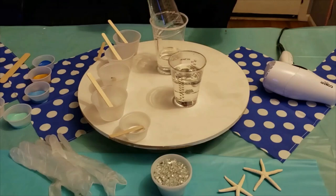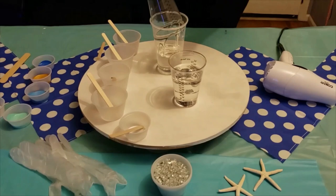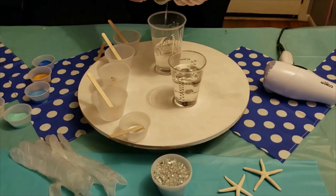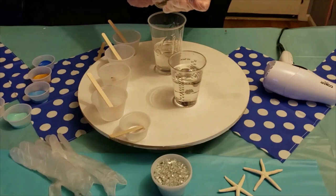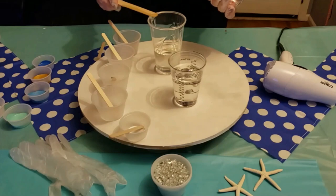Give it a little time to drain. The important thing to remember with epoxy is that it is a chemical reaction and you do have to follow the directions exactly as the chemical manufacturers state. Once that has drained, I'm going to go in with my large stirrer and get the rest of that out. I want to get everything I can out of this cup to be sure that my balance is correct.